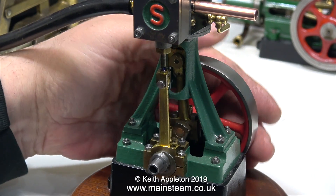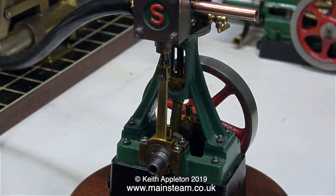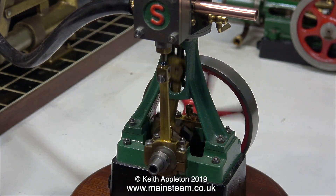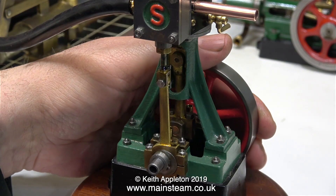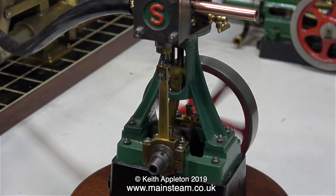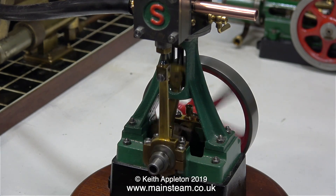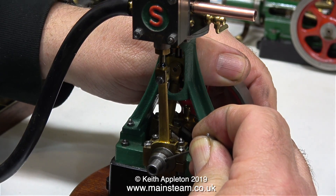Now I'm rotating the flywheel with a little bit of compressed air going into the engine, which tells me that it's still retarded, but not as bad as it was. I could leave it like this because it's running particularly well at the moment, but the timing is still retarded — the admission is still late. Look, it's just after top dead centre. I want it to be either exactly on top dead centre or just a gnat's dick before. For those of you who didn't watch the video when I explained all these strange terms, a gnat's dick is a very, very small amount — and according to one viewer, it's an imperial measurement. So with obsession mode — not OCD, just obsession mode — fully engaged, here we go again.